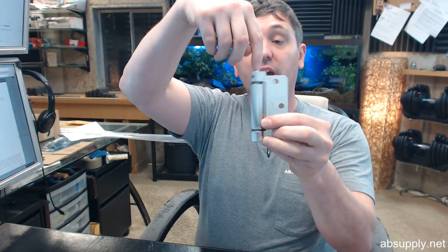Pivot point aligns with commercial butt hinges between 123 and 134 thousandths of an inch. That means you can mix and match this hinge with non-spring hinges so long as the thickness of the leaf is within that range. Specifically, they are not intended to work with a residential grade hinge, because the axis of pivoting needs to be plumb and it would be in a different location with a thinner leaf hinge.